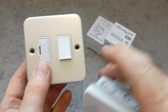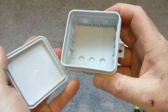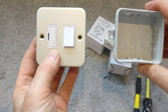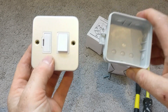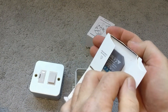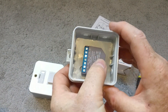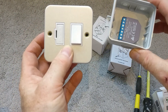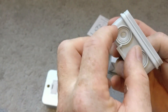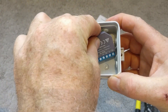I've got this small plastic junction box which is just the right size for a Shelly unit. I'll mount it close to the power unit and run some flexible conduit between the two. The Shelly module sits nicely inside, the supply comes in from the fused unit through the side, and there are little pop-out blanks where I can fit a grommet and run the power supply cables to power the Shelly itself.